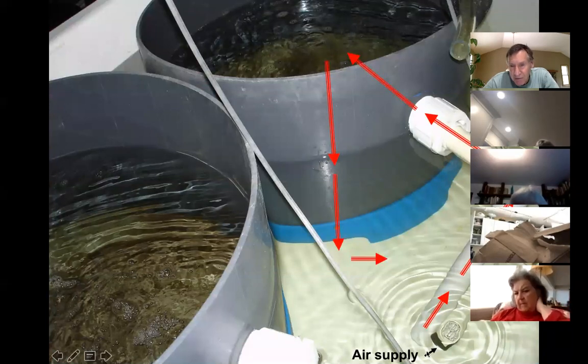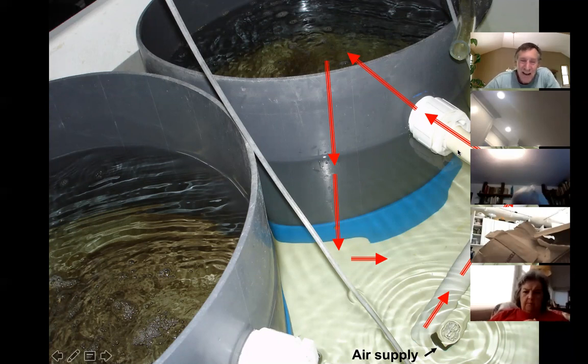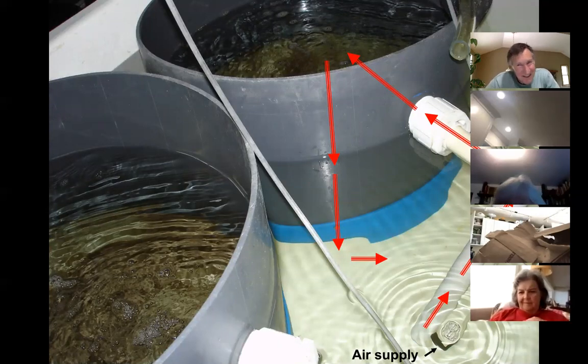And if you have a compressor running, the bubbles will lift the water up the pipe into the silo and it goes down. It's really wonderful. The first thing I ever saw in a hatchery was an airlift tube, and I was like a changed person for the rest of my life. It's like, that's appropriate technology. I tell you, a 59 cent piece of equipment that pumps like a real pump.